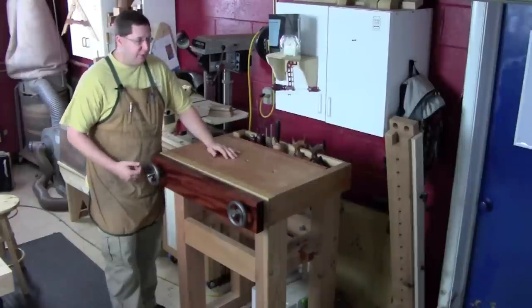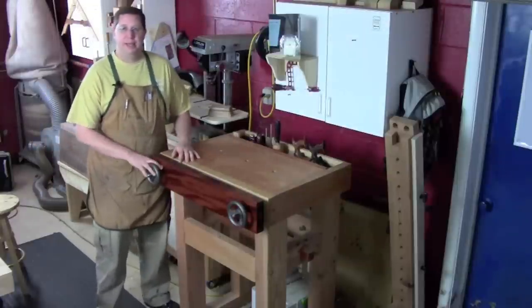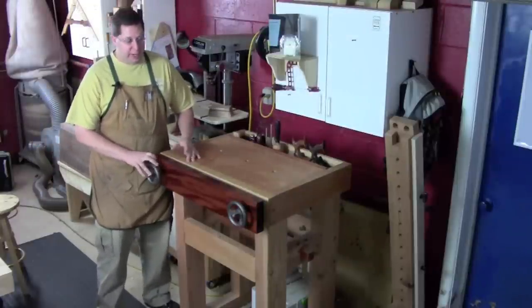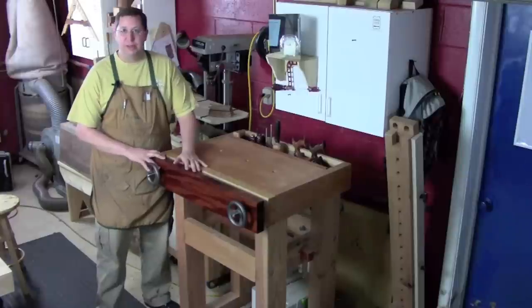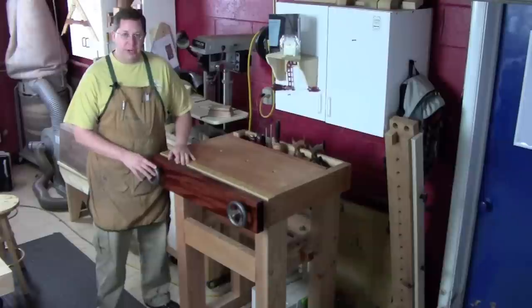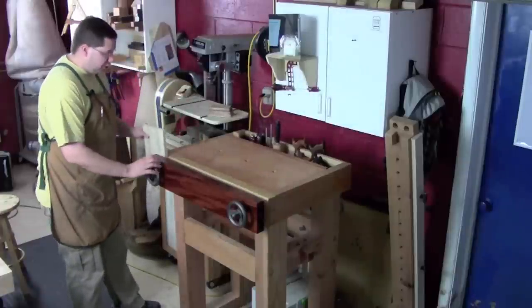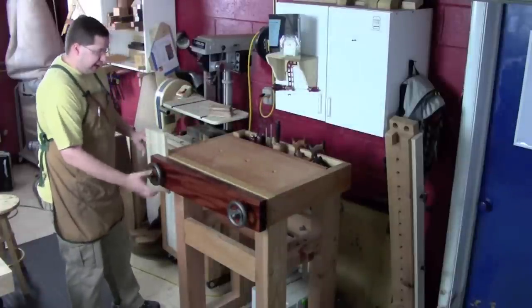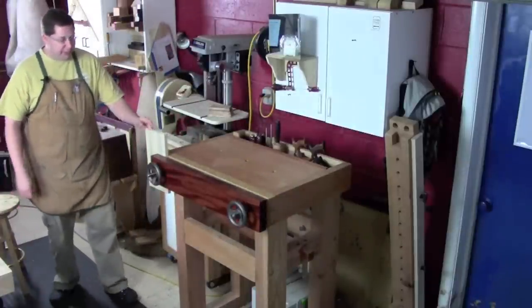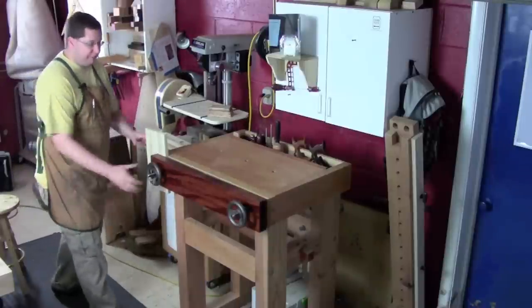As I began to assemble this in my mind, I thought, well, what other tasks would I want to do here? And this front vise handles so many other things. Certainly mortise and tenon joinery works really well here. It cuts great tenons. You can grab a piece, either slip it between the screws, or it also works very nicely on the outboard side. So I can come in and saw, and if I need to come down at an extreme angle, I can saw right off the bench.